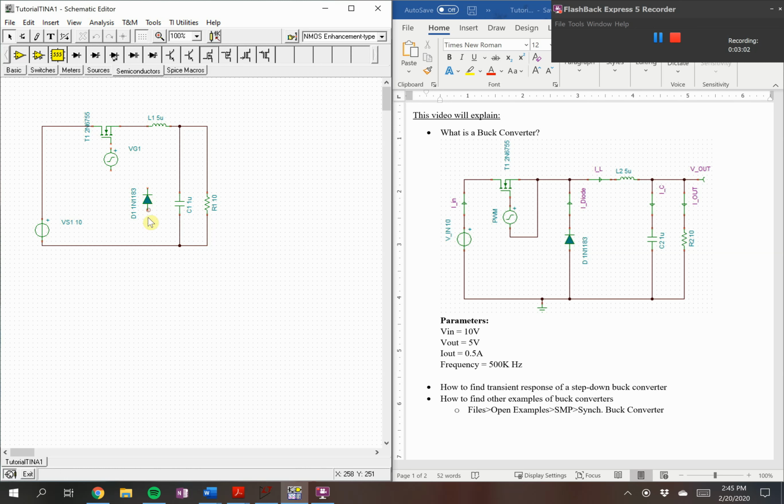This is considered an asynchronous buck converter because it only has one MOSFET. Synchronous typically has 2 MOSFETs, which is controlled by a gate driver. We'll be talking more about that in the next couple of videos. For the PWM, we want to make sure we connect back up here and not towards ground. Speaking of ground, we do need one. Let's not forget that. And we're just cleaning up a bit here. For the sizing of components, we'll be talking about that in the next video as well.